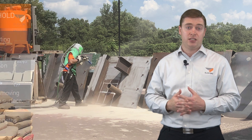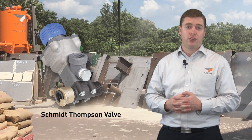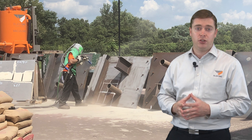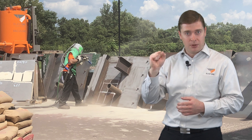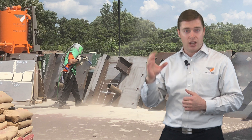The Thompson valve from Schmidt is a superior product for pressure hold systems. We've found that a Thompson valve will save contractors about 10% of their blasting costs. Using a pressure hold system like the Thompson valve will give you a two-second start and stop response — when you start blasting, stop blasting, start blasting, two-second response. Whereas a pressure release system will be at least five seconds in blowdown.